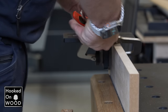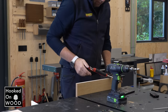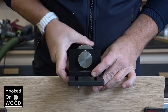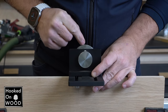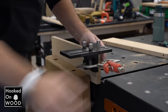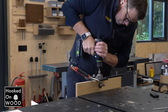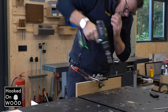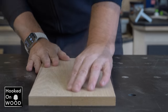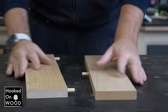Perhaps this sounds a bit complicated, but it is very straightforward once you have used it. The wheel has a stop at every quarter of a millimeter, and that turns and feels very solid. There is zero movement when you clamp the doweling jig in place. Now it is just a matter of drilling the holes for the dowels. This doweling jig comes delivered with 6, 8, and 10 mm bushes. The result is perfect — it did not matter how I turned my workpiece, it was perfectly aligned.